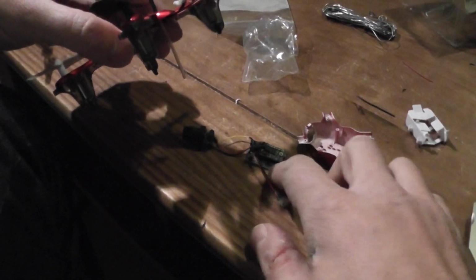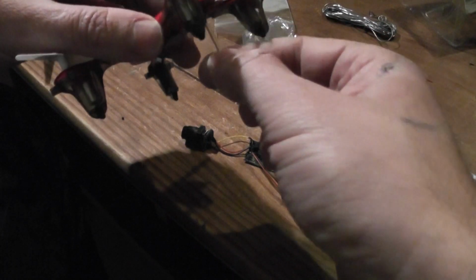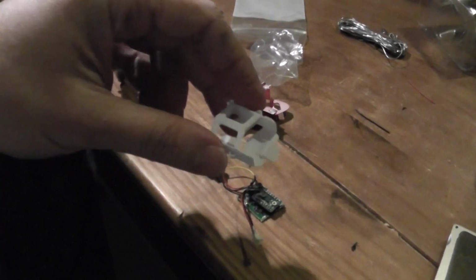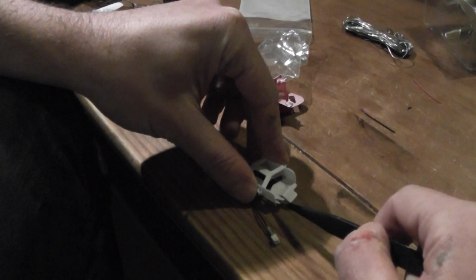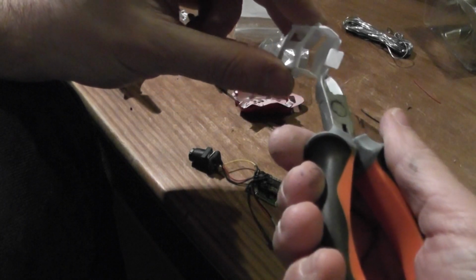It will be the trickiest part: I will need to install the VTX and start to solder the antenna directly, with the antenna pre-installed, because I have no choice except to cut here, which I don't want. So I will continue now. Okay, since the antenna will be soldered on the left part like this, if I'm not wrong: ground, antenna and ground, so it will be soldered on the first 3 pins there. Since the battery bay will be over it, I will cut this part to access it later to install the antenna cable. So I will cut like this.